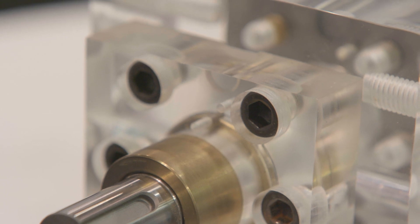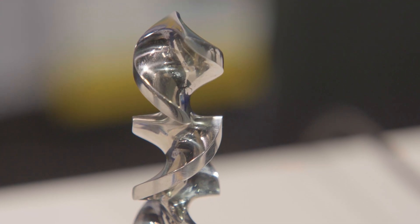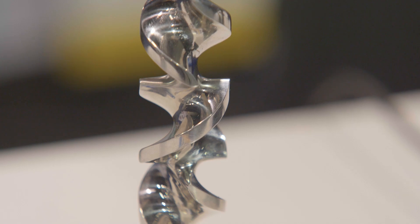If we think about an extruder, it's taking that material, melting it, bringing it through the barrel, and as that's happening, you're getting pressure variation in the barrel. That pressure variation makes its way down to the die, and that's just a normal part of the extruder. If you add recycle in, and now you don't have a consistent feed shape, you're going to have material melting at different rates. As that material melts at a different rate, it generates a surge in the extruder barrel, and that surge makes its way down the barrel and gets into the die. So most processors have to limit the amount of recycle they can put into the extruder in order to get a stable output.